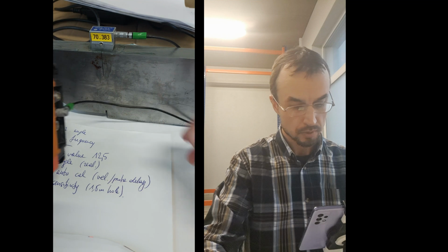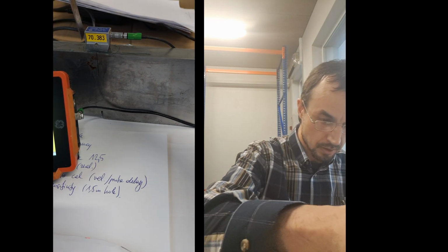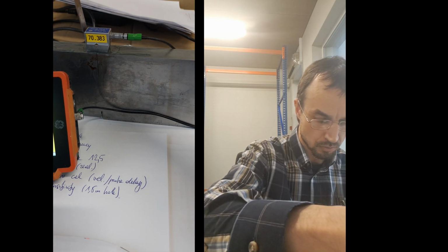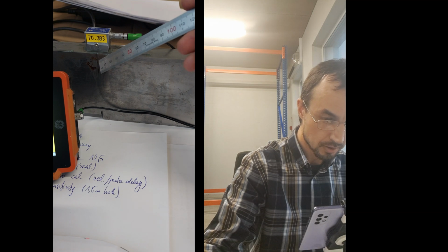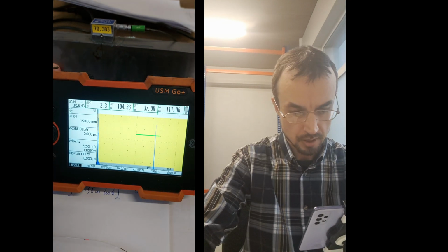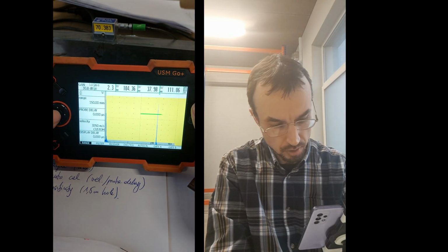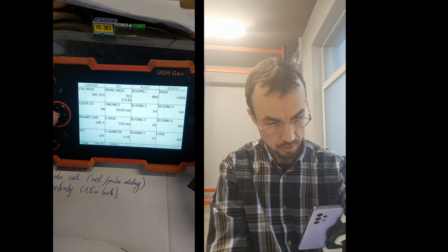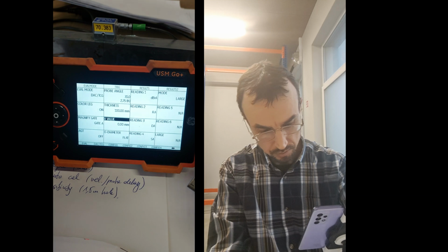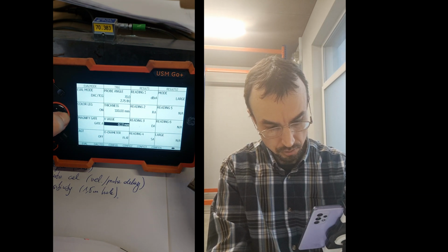What I do then is put it into the machine, because when we put this number in, we will measure the distance from here automatically, from this wall of the probe. So we need this number to put in. And where do we put it in? I think in the big menu, somewhere there. So let's go into the big menu with the middle one. X value is here, and I put 12.5, so I am increasing this to 12.5.